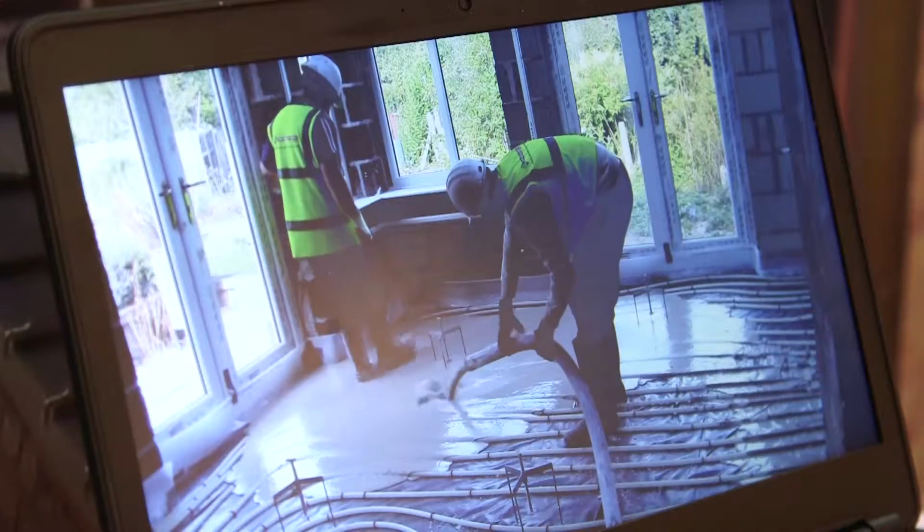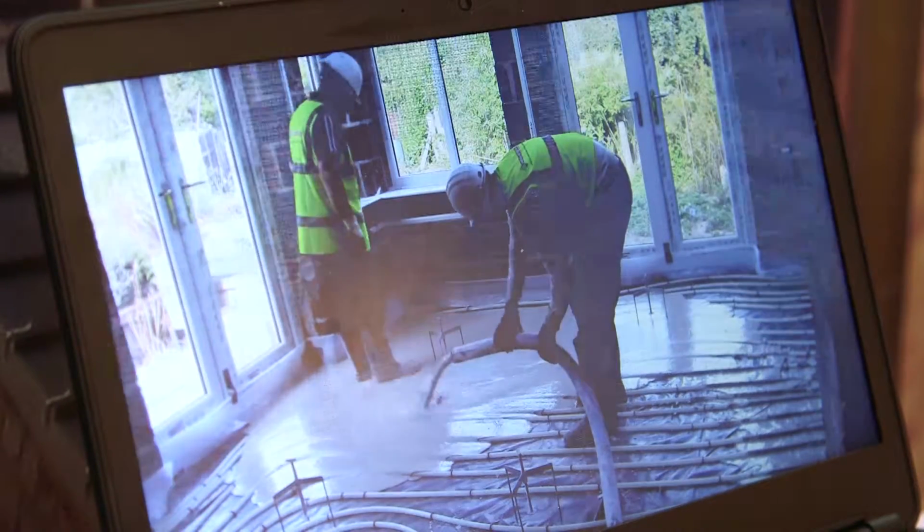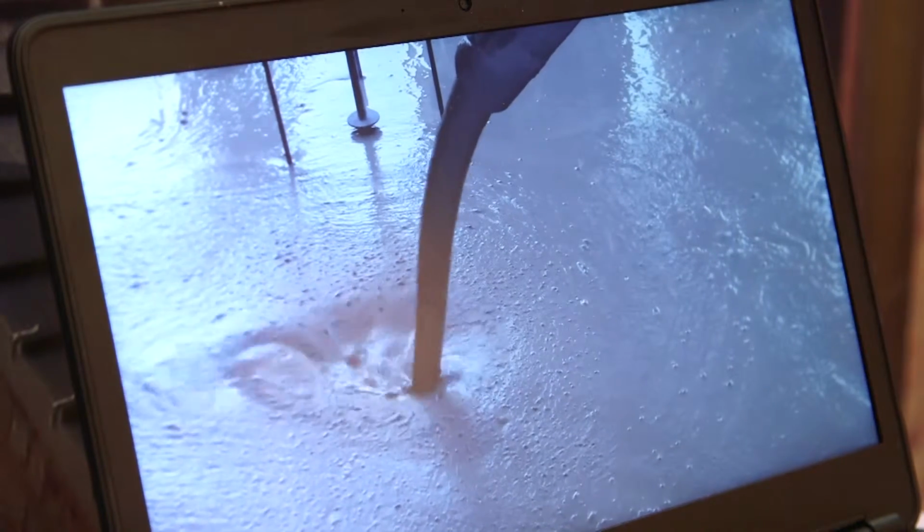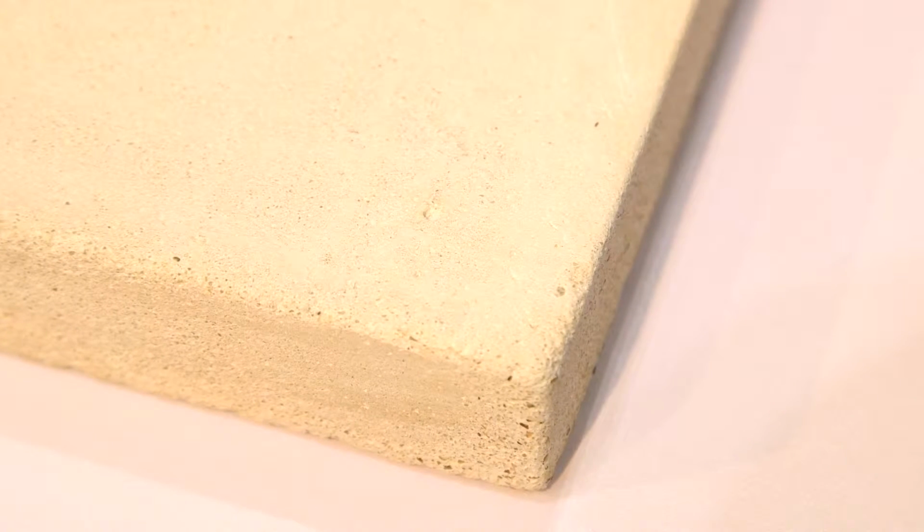We then manufacture it into a floor screed binder, and we supply that to screed manufacturers such as Cemex, Aggregate Industries, Hope Construction Materials, and a number of other smaller independents. They take our powder and they mix it into a floor screed. It's a very simple system. They add sand and water, and that's it. Floor screed is basically a layer of material which goes onto a rough construction floor, and it acts as a carrier for a floor covering or an underfloor heating system or those sorts of things.